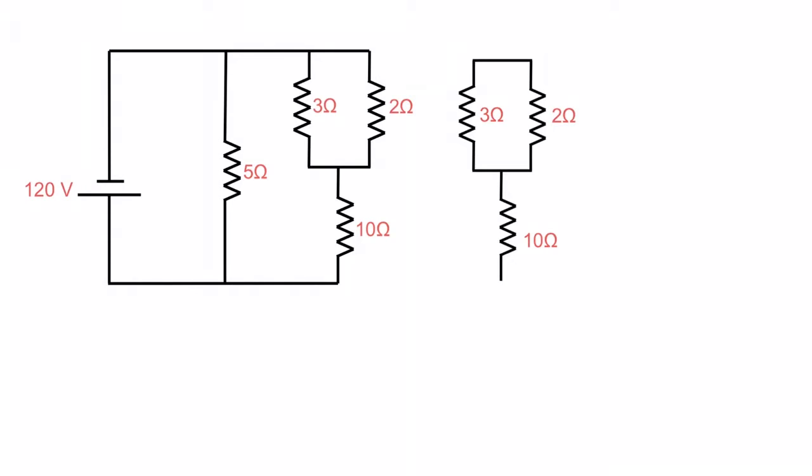What I've done here is I've turned it into one branch: the 3 ohm resistor and the 2 ohm resistor in parallel, in series with the 10 ohm resistor. Now we're going to crush the 3 ohm and the 2 ohm resistors and see what happens. 1 over 3 plus 1 over 2 gives me 1 over 1.2 ohms. Squished together, those give me 1.2 ohms, again in series with the 10 ohm resistor. So now we add the 1.2 ohms with the 10 ohms